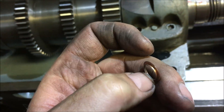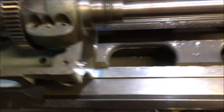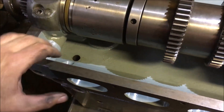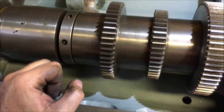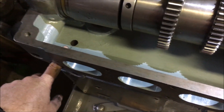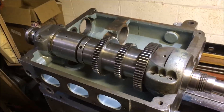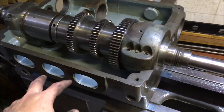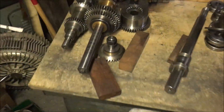I don't think they need to be top hats like that. Failing that, it's a bit of mastic underneath the end of each of the cap heads and that will stop it. I'm also considering making some little brass plugs that will just be a press fit — there's not an awful lot of oil that goes in there, but it seems daft having that hole right next to the fill point. Once the headstock's on, I've got to put the gears back on that are sitting underneath this and remember how they all go together.